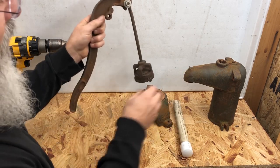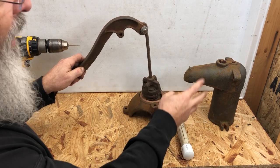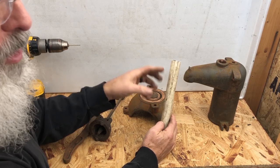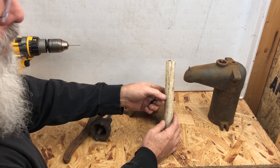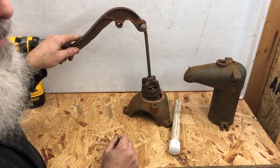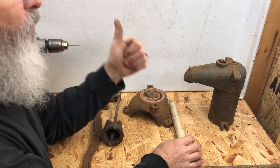This happens slowly — that's why your hole is so small. It will slowly allow the water to drain out of your pump housing, all the way down the pipe to the weep hole. When you need water, you simply begin pumping. The hole is so small it's not like water is gushing out — you're not fighting it. You already have water up to that point. When you're finished, remember to leave the pump handle in the up position, resting on that, so it allows everything to drain back out. I hope this helps people with their pump and pipe freezing problems. Good luck with your projects.